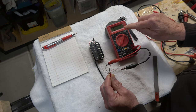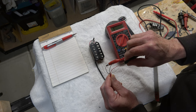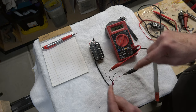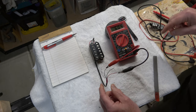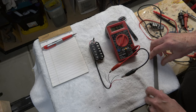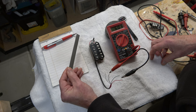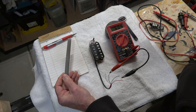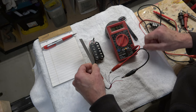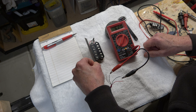Now I'll test the white wire — and as soon as I connected it, I get a readout. That is the DC resistance of the coil that the black wire and the white wire are connected to. To find out which coil those two wires are connected to, we're going to tap the pole pieces with a piece of ferrous metal — a nut slotting file, though you can also use a screwdriver, butter knife, or any magnetic steel. We start by tapping the screw slugs, and the number changes but it's not very dramatic. Now tapping the other poles, the number drops pretty dramatically — it went from six down pretty significantly.